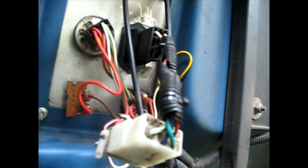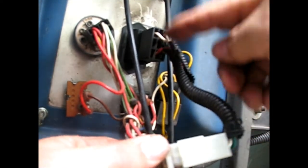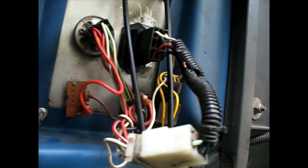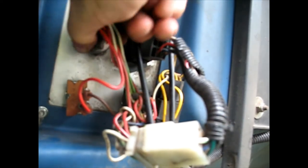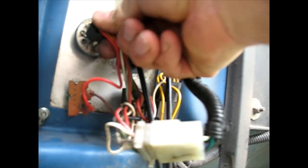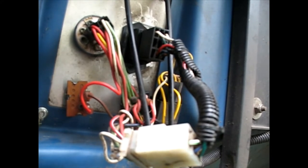I'm not sure if you have to be on the seat on this one to make it crank - as long as you've got that emergency brake on I think we're okay. Just looking for anything loose. When I got over there he had this wire off like they were looking at it, and he believed there was a problem with these two wires touching, but they're no longer touching. I'll pull this and look for some corrosion on the ignition switch. Terminals don't look unusually corroded. Try it again - and now I can hear the fuel solenoid clicking on and off at the carburetor.